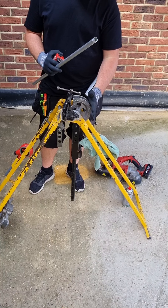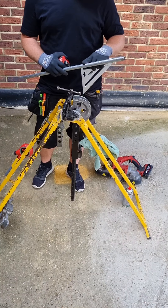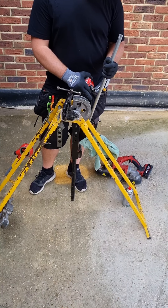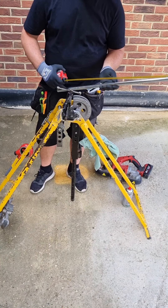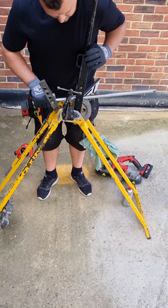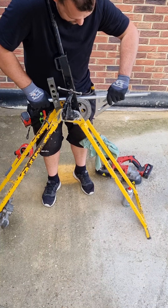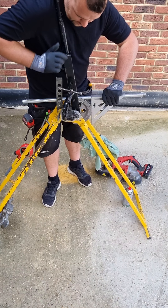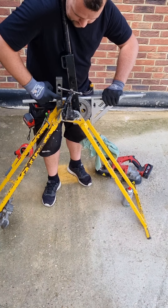First off, I'm going to use the back of the bend method, which is using a set square off the edge of the former which you've measured to get an accurate measurement. I'll show you that now quickly, because each former can be different, so you're going to want to take your measurements as you go. The best way to learn it is to bend a piece of conduit and mark say 300mm, as I already have. I'm going to place it in the bender and use the set square on the 300mm mark. I'm going to place that at the edge of the former and try to keep the stock at the same height every time — keep it level and don't move it on the pins, because they can vary your measurements too.